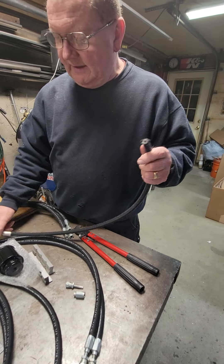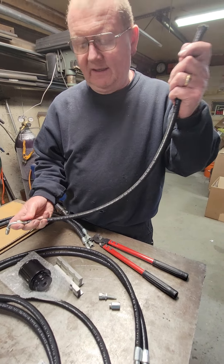Having connected this end to our master cylinder, we can mount our master cylinder reservoirs to our inner fenders. We can line up the hose with the end of the fitting where we're going to cut it off. You can use your cutoff method of choice — wrapping it in tape, hacksawing through it, cutting it off with a cutoff wheel, whatever you're doing to cut it off.